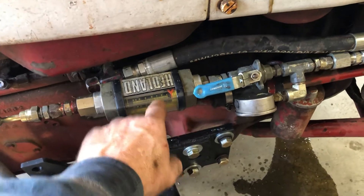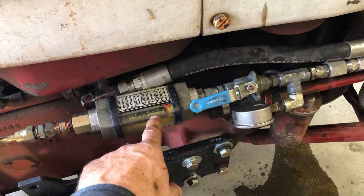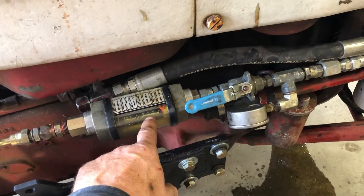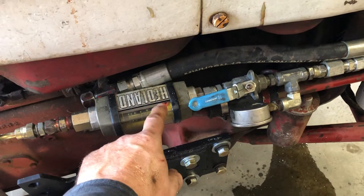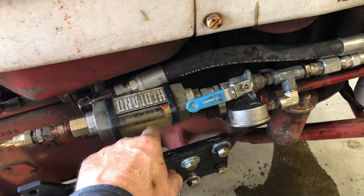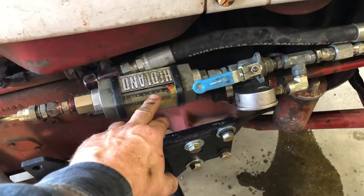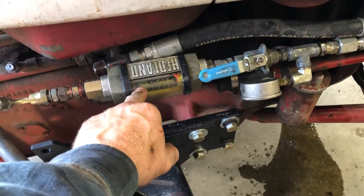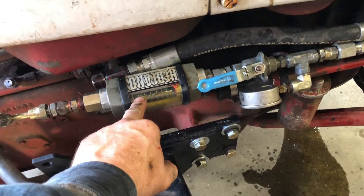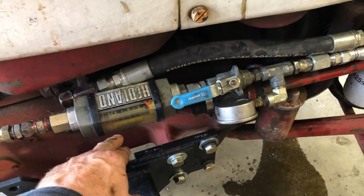Thank God, because they're about $600. If I turn the idle up just above idle — which would be probably what you do on light duty work — I'm getting about 5.5 gallons of flow and I'm still maintaining my 2,000 psi back pressure. I tested at excessive idle, higher than what I'd normally operate at, and I'm getting around 9.5 to 10 gallons a minute flow.